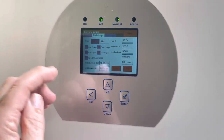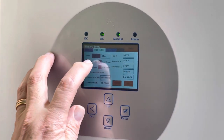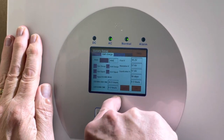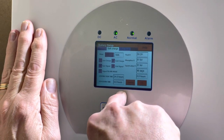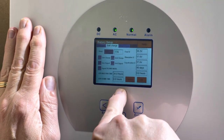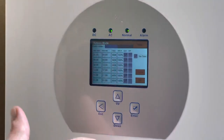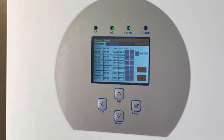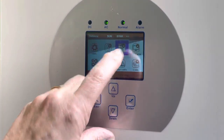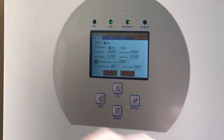This is the maximum battery charge setting. Because we're going to be using off-grid — not grid or generator — we can take the battery charge setting up a little bit higher. Don't forget this is the battery current setting. Here is the system mode — I've set 'use timer' with everything at 100%, so basically the battery will pull from the grid and charge to 100%. I've now gone onto the grid setting and used grid peak shaving at 1.5 kilowatt.